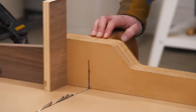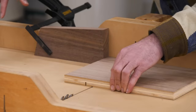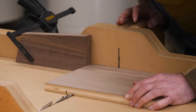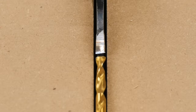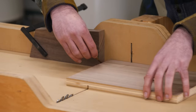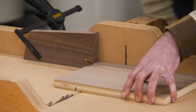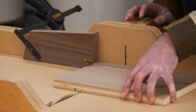With that done, I remove the spacer piece and reference my workpiece against the stop block. As you can see, doing that would give me a dado that's exactly one blade kerf wider than needed. So I need something to nudge my workpiece over by the exact thickness of that kerf. As it turns out, most blades have an eighth-inch kerf, so we can use an eighth-inch drill bit as a spacer. If you have a thin-kerf blade, the same principle applies — just use a smaller drill bit, most likely a sixteenth of an inch. I then use that drill bit as a spacer to establish the other side of the dado.